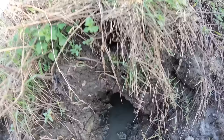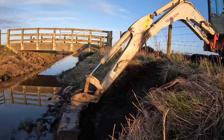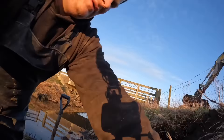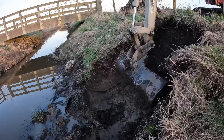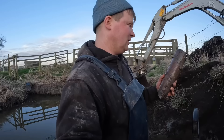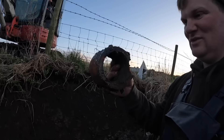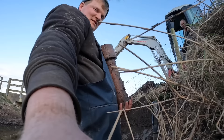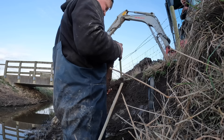Then it's obviously fallen in with the bank, so he's going to take it out. Don't bother about what it looks like - that's a 2-inch pipe in 3-inch tile, 2-inch collar. That was a collar - it's like the Roman Empire here. In the 1920s and 30s, the muck getting in between each tile, the tiles were handmade so they weren't as good an edge. Look at them - that's a 2-inch collared.